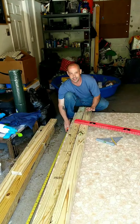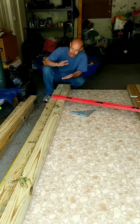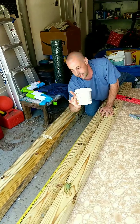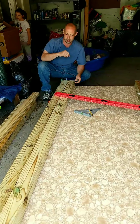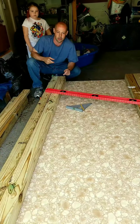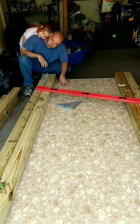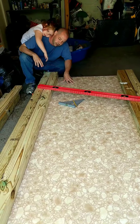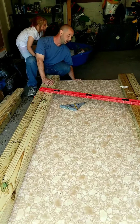Alright, we're back here. We've got the vinyl down, letting the glue dry. Believe it or not, that tiny little bucket does work for a four-by-eight sheet — you just gotta stick with it, spread it out, you just gotta move quick. Got the vinyl down; it's drying, a little soft in the corners but that's expected because of moisture. We're just going to let that sit. Supposedly 12 to 20 hours is proper curing time, but we'll see. I've got the four by fours on the edges to make sure, and left it uncut so the weight will keep it down.